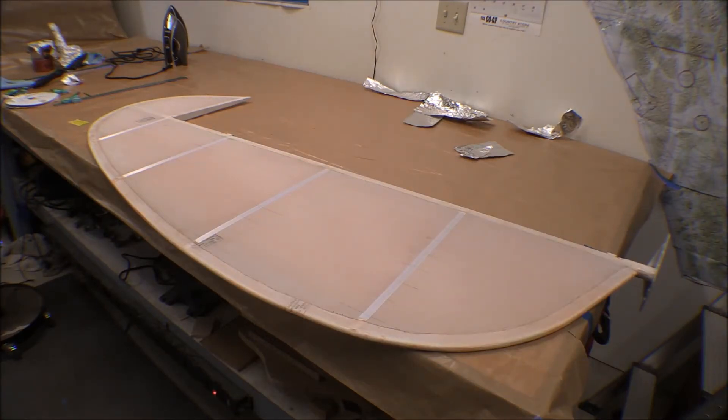I've got the first elevator in the pink, marked out where my stitches go, and I put the reinforcing tape on there and have that trimmed up so it's ready to poke holes in the new fabric and stitch it up.